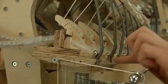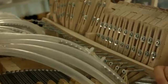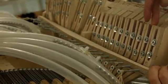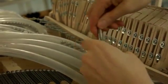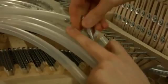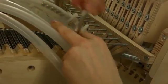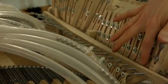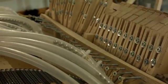The timing of each note is decided by a screw that is up here on the machine. You see this screw there? You see it, Hannes? Yep. For example, say this note, which corresponds to the low C on the vibraphone, is a little bit too early. Then this lifting finger is too much like this, and we can adjust that by screwing this clockwise. Like that. Sorry. And you will see that it goes like that. The programming nail will hit this lifting finger later, and the C of the vibraphone will play a tad later, which will make the machine tight.